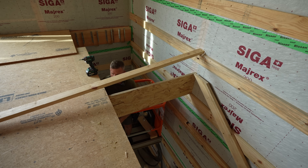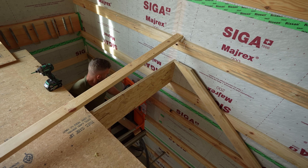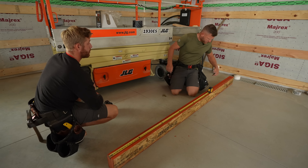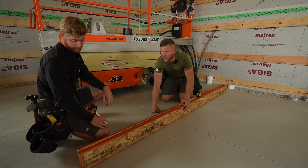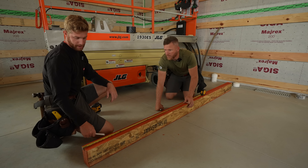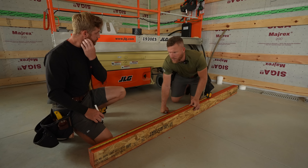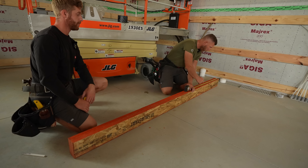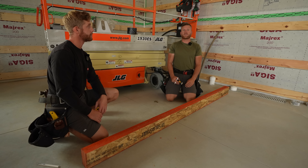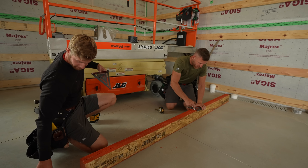52 inches is my wall mark — inch and a half, then another inch and a half. Mark a jack stud. We're on seven, so mark five and a half and four. We're using LSL only because I had enough left over to piecemeal through these sections — trying to get rid of some inventory and clean up. It's pretty awesome stuff, super straight, so that's kind of nice.